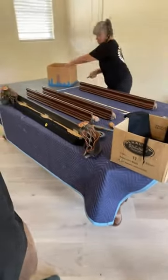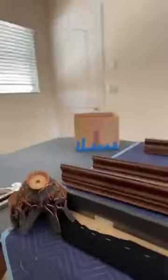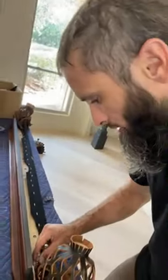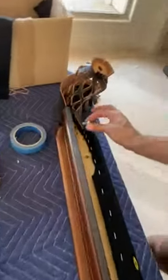And then you're gonna get the Phillips screws that come with it, the hardware, right here. And you're just gonna start them off. I recommend hand threading them in there, because if you use a screwdriver or a tool prior to it, you can often cross thread it and strip it out.